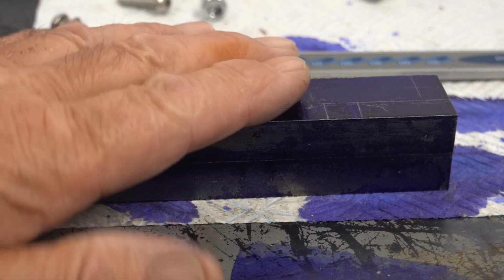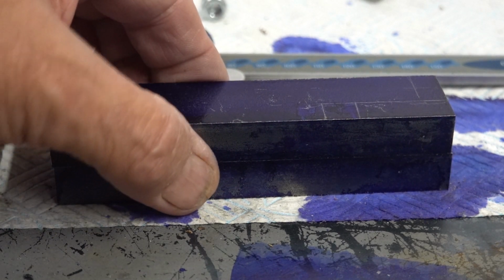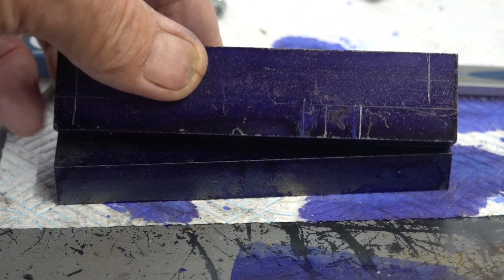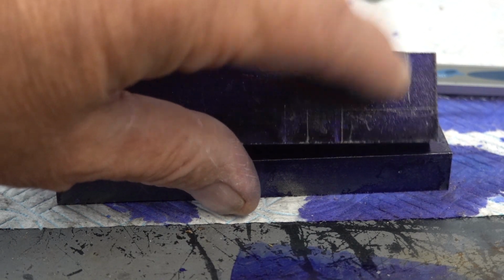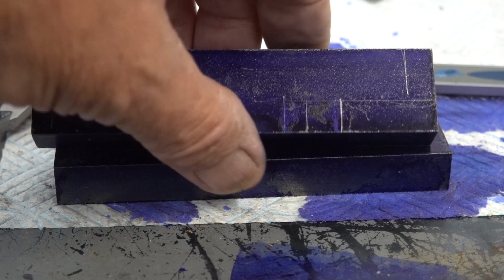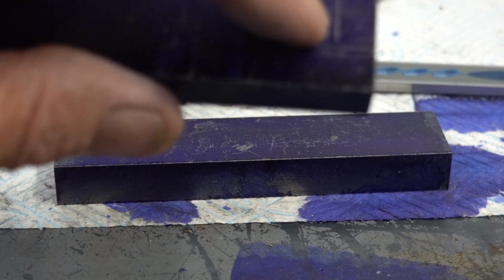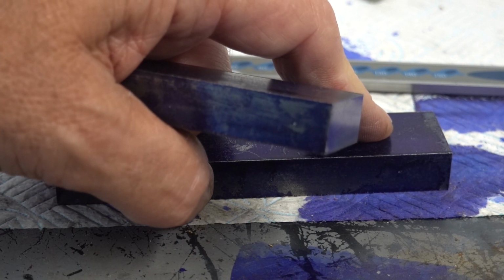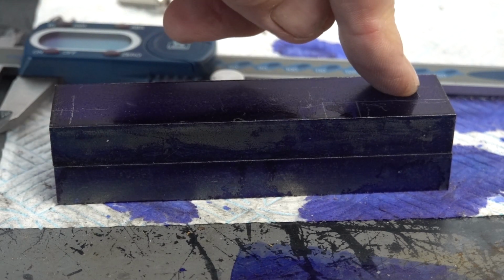So it's come to the time I'm going to make a start on these two jaws for the knurls, and I've marked out roughly on there which is where the radius will be, and the cutback on there and across there, and then there's a hole here which I've marked using the mics and scratching, but obviously they weren't done on the DRO properly. This one is a 7/16 ream through hole that carries a bush, and the other one is smaller, that's only a 5/16 ream through. So I'm going to run through with a 5/16 drill on that one.